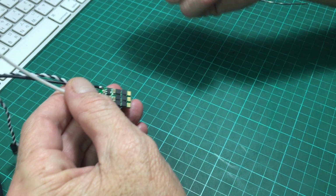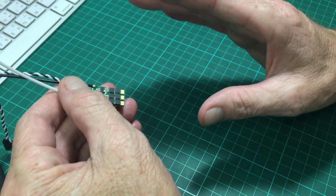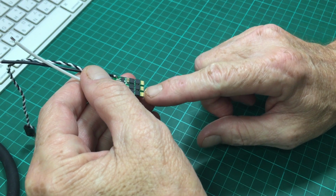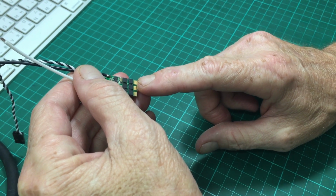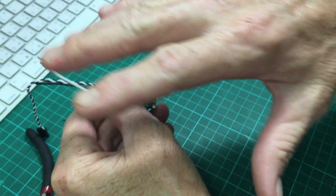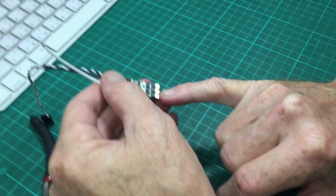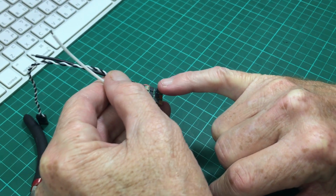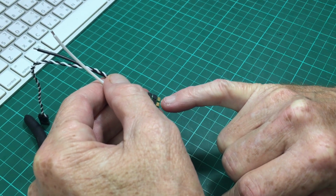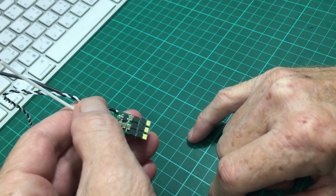you know, a wall plug iron type thing, or if you're using a soldering station with not enough heat, it basically means you're going to need to hold your iron on these for too long, and then you end up having issues with the NFETs floating around on the PCB, because the heat transmits from these pads so quickly to these small NFETs right next to the pads that what guys are doing is they're desoldering the NFETs on there.